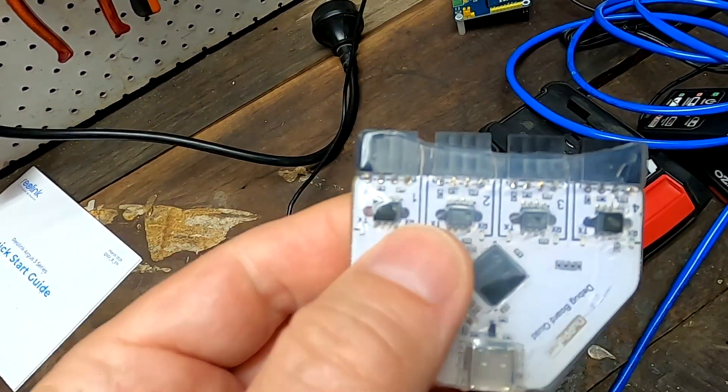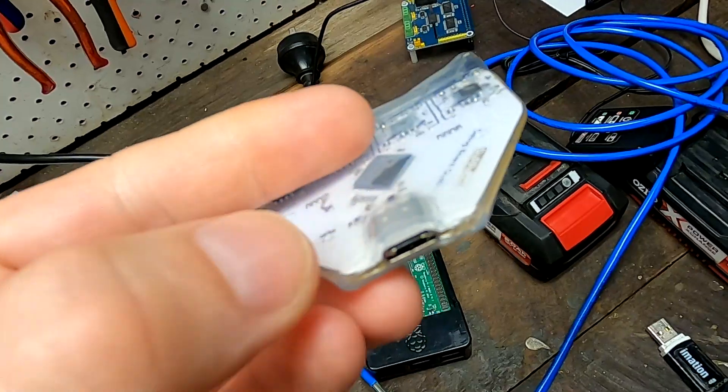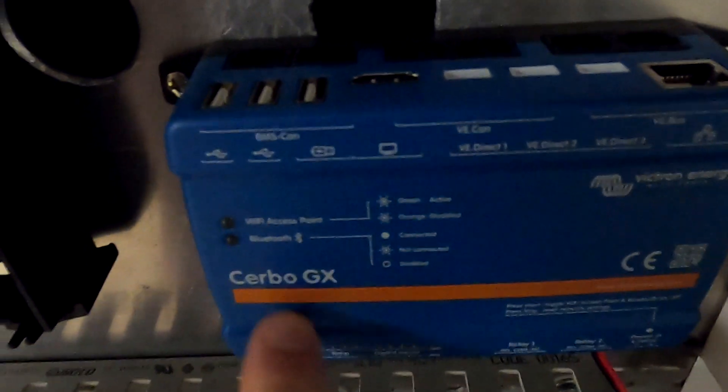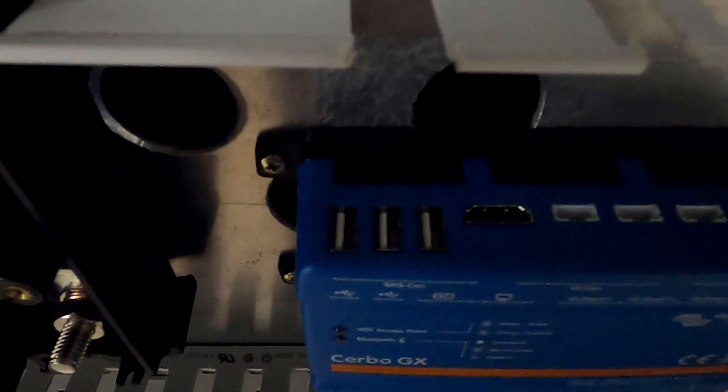On the PCB we can clearly see the isolation — there's a little gap to make it really obvious that this is an isolated board, and you can see these optocouplers sitting on top of that gap. This device uses only one USB port to connect four devices at once, solving the issue of not having enough USB ports on the Raspberry Pi. The Pi only comes with four USB ports by default, and the Cerbo GX actually has only two working USB ports. So with two of these devices you can already use eight VE direct connected devices.